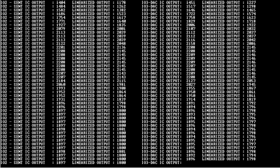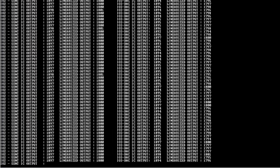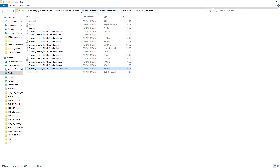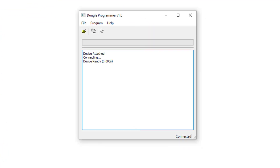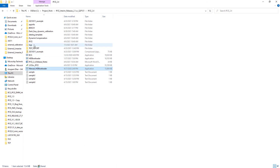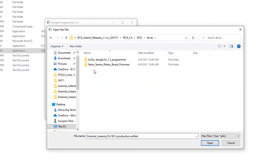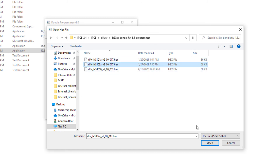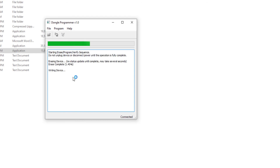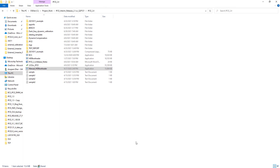To revert the LXM9518 programmer back to its normal state, put it back into bootloader mode by pressing Shift and '>'. Close TerraTerm, open the bootloader application — the device will be detected again. Then load the original firmware from the IPC folder, under the driver section: LX3633 dongle 1.5 programmer, loading the LX3302 version 17. Flash the firmware file, then eject. The LXM9518 programmer is now restored.